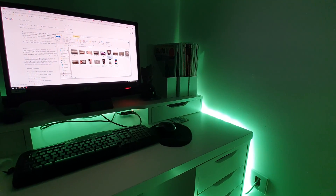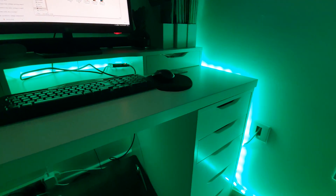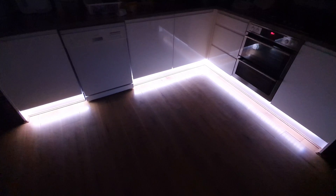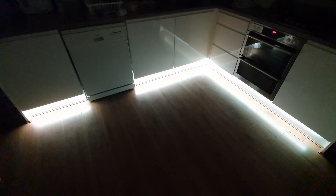It's actually a really nice, premium product. It looks and feels really good when you're using it in the app and seeing the color changes. So even though it's only got 0.83 amps compared to my DIY one at 5 amps, it doesn't matter all that much. It's a bit like a Ford and a Ferrari both doing 100 — they work differently. Or a CPU from 10 years ago running at 3GHz vs a modern one at 3GHz. I was naive to assume amperage alone determines quality; Philips Hue likely uses more premium parts than a DIY strip bought on Alibaba.